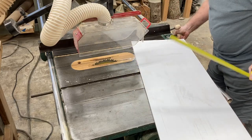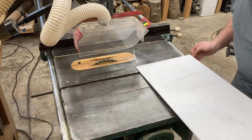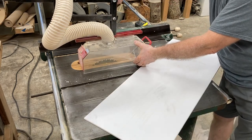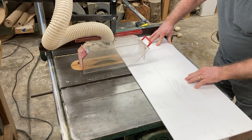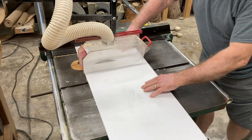The original design for this sign was 8 by 10. I'm using a center point as my XY zero position, so I decided to make the sign just a little bit bigger. I wanted a little bit larger border around the outside, so instead of the 8 by 10, I decided to cut this sign 8 and a half by 10 and a half.